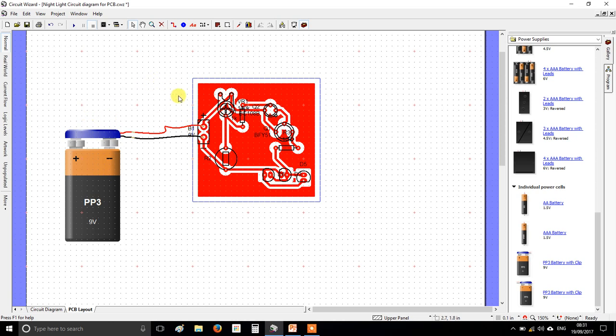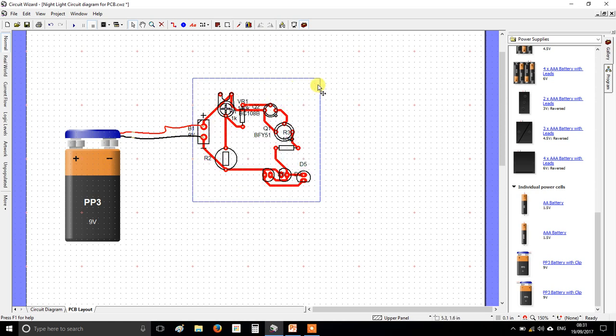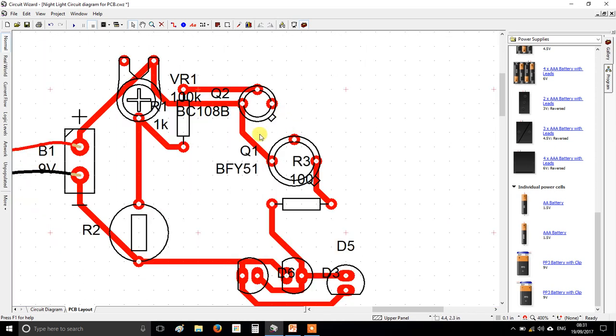Anyway, what I would advise for the next step is go to normal mode, and we're going to delete every connection the computer made but leave every component behind. So that means select a part on the screen, say there's background, and press delete on your keyboard. Select this border, delete. Each of these tracks we're going to delete. If you make a mistake, just do Control Z, by the way, that'll bring you back. Delete the tracks.